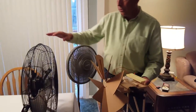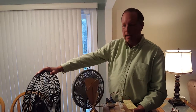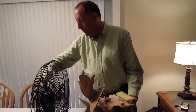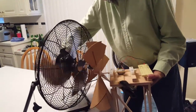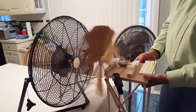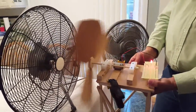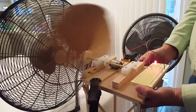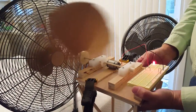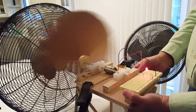Next, we'll turn to a more industrial type fan which has a higher output, more air and a faster velocity. I'm going to put it on the lowest speed first and let's see what happens. As we see, the fan blade is spinning much faster than it was on the other fan and the LED is glowing bright. When I did my experimentation on this, I was getting 2.5 volts out of the motor.